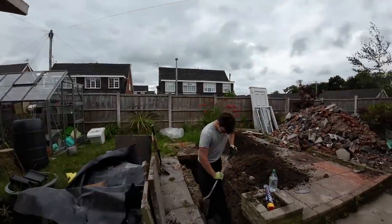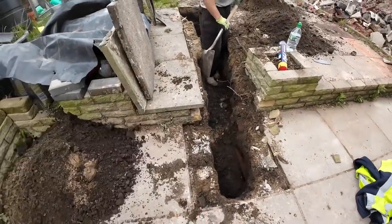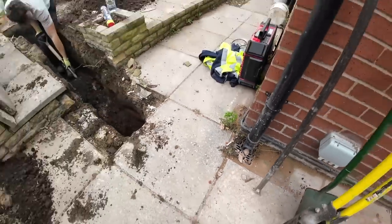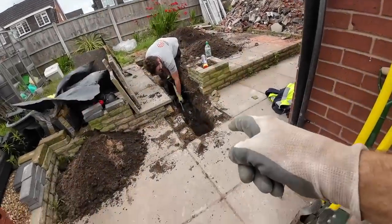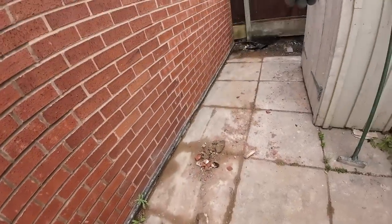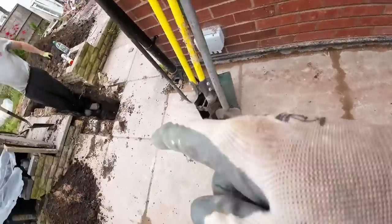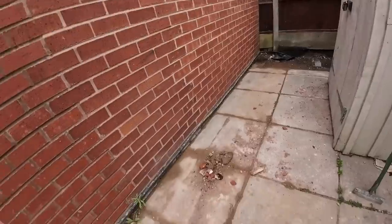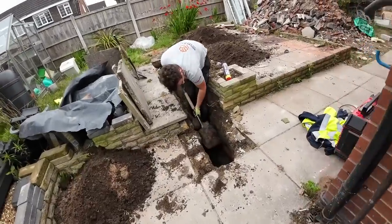So, going great guns here, nice, beautiful soil. And even down to nice white sand now, down this section here. As you can see, we've got a pipe running down parallel with our channel, which is staying in. So we're going to come along here, roughly alongside that gully, and then we're going to put a very slight turn in it up to our new gully there. Even that doesn't have to have a slight turn. We can come straight along here and then just put the bend into the gully at the end there. Because we might be a bit close to the foundation there. I'm guessing this foundation isn't very deep on this extension. So yeah, coming out nice. Very nice.